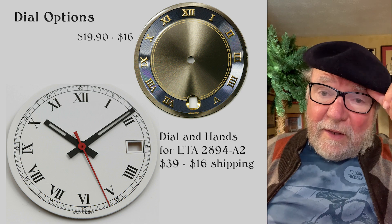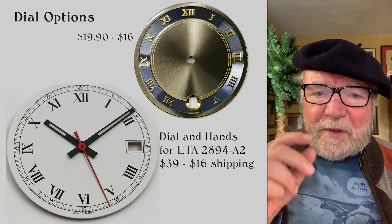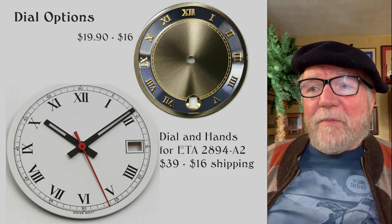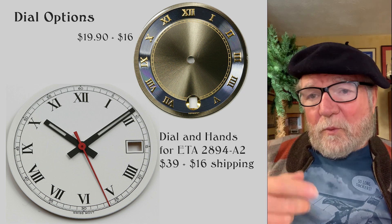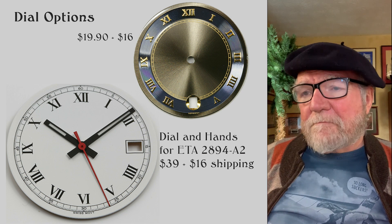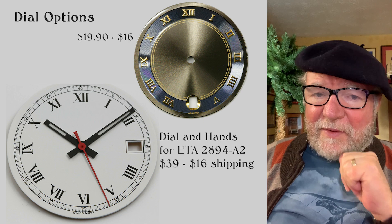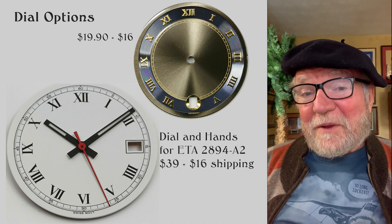The final thing is a dial. What I like most about this particular movement is that it has center seconds, which means you've got three hands and you put one on, put the other one on, put the other on top of it — I love working with that rather than trying to get a second hand into a small seconds position, which can be a challenge. The date window is on a disc that goes around. You can have it at three o'clock, like the white one shown at the lower left, or you can have it at the bottom, like the dial shown on the upper right. You can get all different colors. The size is very important because dials have feet that have to go onto certain places. If they don't have feet, there's something else to hold it in called dial dots, which I've used before, but it's considered not the best way to do things.